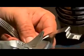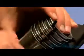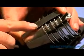This clamp has got to make good connection for electrical reasons and for holding reasons. But it's a flat surface and you're connecting to a round surface, so it's never going to touch perfectly. And I'm going to show you the best way to make it happen. So you cut it a little long. Now it's time to make the L.